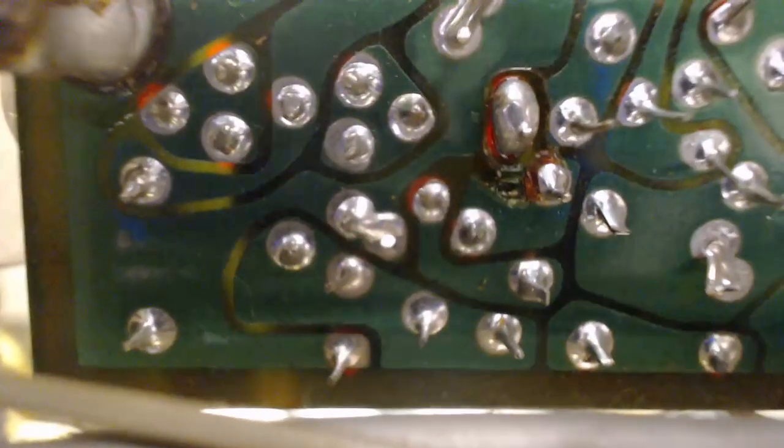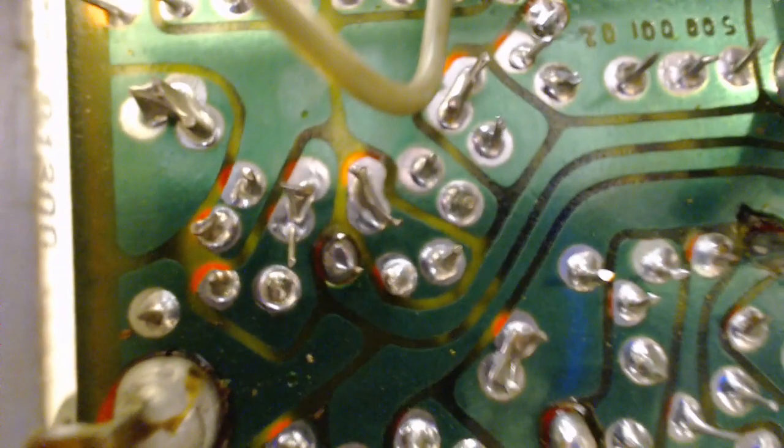So let's look at the radio. Okay, here we are looking at the board, and you see the first trace, and then the second trace has four terminals. Any one of those will do as a test point. If you look at some of the soldering here, it's a little unnerving. It almost looks like it's cracked. I've seen cracked solder, and this has the look of it, but I don't think it's actually cracked. I think it's just the way things look in here. Maybe you'd have to get an even closer view of it to be able to see if it's cracked.